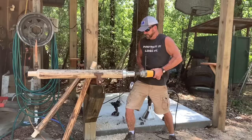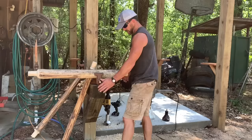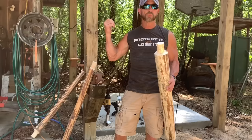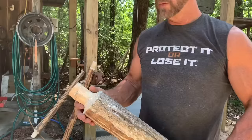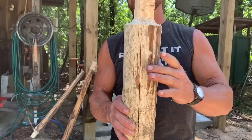You saw it stop that drill — and that drill ain't even on the extension cord. That's just what I'm talking about. It was already milled down by the big drill, and just to cut that radius, the smaller drill was having trouble with it. It's got a place, it's just not on these bigger bits. That's why I say the big three-quarter drive. Now look — see the difference? That makes that radius a little bit different. Tapered versus radius.